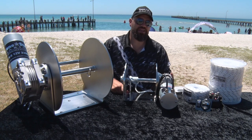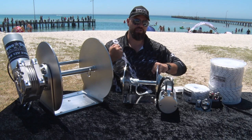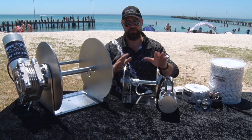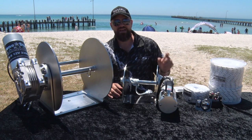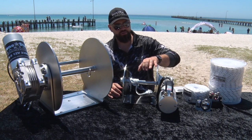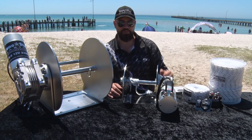Lots of tension. Now when you take it out for the first time, get it wet, and put it under pressure, that rope's going to stretch even further and it's going to pack even more tightly on the drum. So when you first fill it — especially a GX1 or GX2 — your rope and chain's going to be quite full, right up to the edge. After you take it out a few times and it's been under a bit of load and pressure, your overall diameter's going to shrink a bit, which is going to give you a bit more room to play with with the chain coming back on the drum.